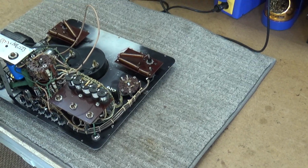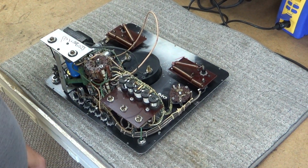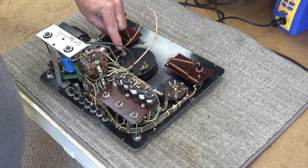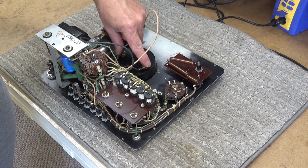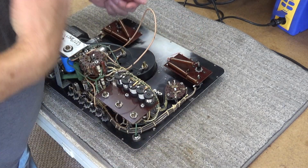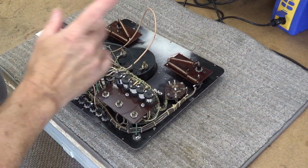Alright, I'm not sure where you guys want to be placed. Let me move you just a little bit. I already had this shot made. Let's get the carpet out. Finally, the meter movement's right here, as you can plainly see. I'm just going to take these 2 nuts off to get the leads off, and then there's a 1/4 inch nut right there. This whole thing should just go out the front.